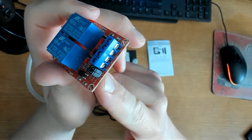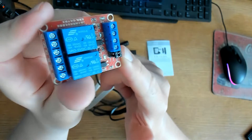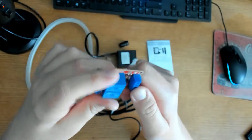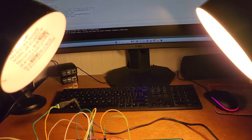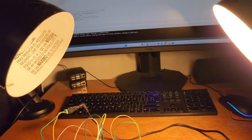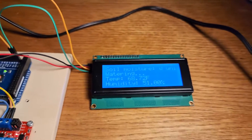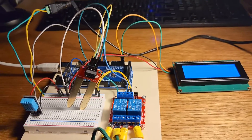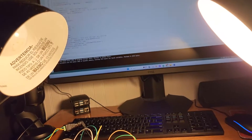The pump and the lamp will be controlled using the two-channel relay. The relay allows a low-current device like an Arduino microcontroller to control high-current devices like a pump or lamp. It does this using an optocoupler to transmit electrical signals between two isolated circuits. Here's everything set up. I used a lamp in place of the pump to test — the lamp on the left represents the pump. When the soil sensor returns a value below the threshold in the code, the pump comes on, stays on for four seconds, then goes off.